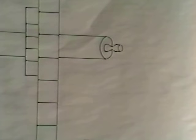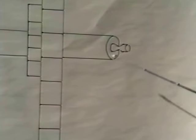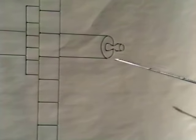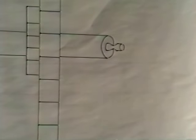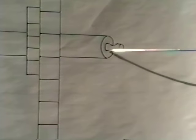I made up some drawings to show you exactly what I'm trying to do here for you today. Here's a very, very bad worn pivot. The center of the pivot is worn out — it's so big in the hole that it's virtually useless in the clock. In my estimation, that pivot should be cut off, re-drilled out, and replaced by a new pivot.